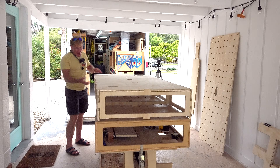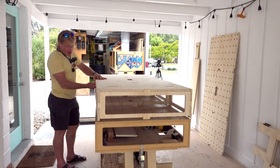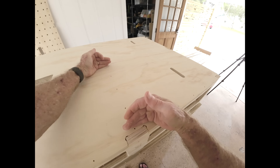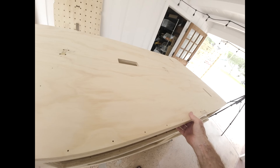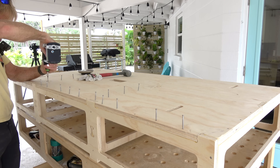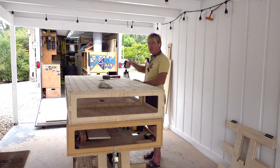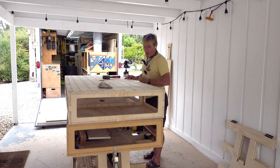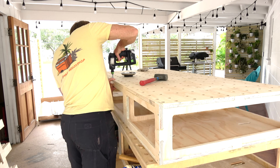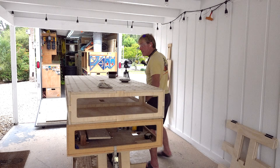There's really no fitting required — everything is held together. As I'm screwing the top together there will be a little flex in the middle of the sides because they're thinner and can move a bit, so I'll make sure to flush those up with my fingers as I put in the screws. I'm going around doing my alignment, putting in just a few screws while the glue is still fresh before it tacks up, and then the rest will just be filling in the holes, just like we did on the bottom. It also helps a little to drive a screw straight into the tabs in the slots — I'm finding I don't have to pre-drill, it's not splitting.